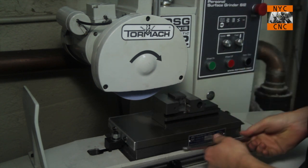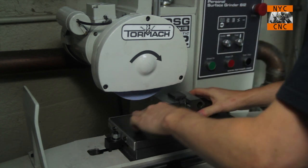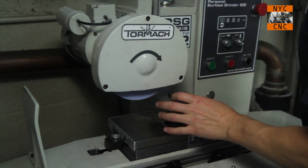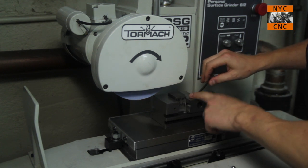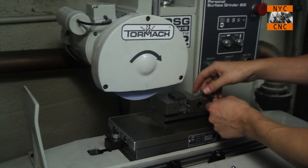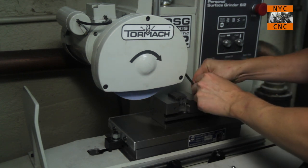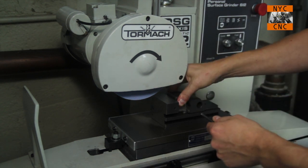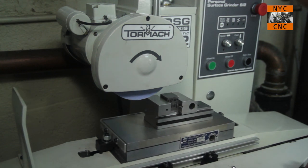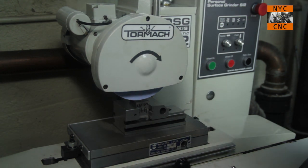We can use the key here to turn on the magnetic chuck — so that's not going anywhere. We've got a level surface there, so we can use this toolmaker's vise I bought from Tormach. It's really nice — nicer than the other ones I've got. It's got a spring in it that makes it easier to stay in each notch. We'll move the table over with the hand wheel, and this controls our Z. We'll go close.